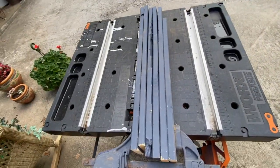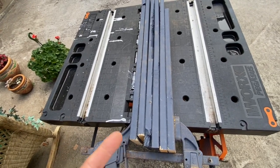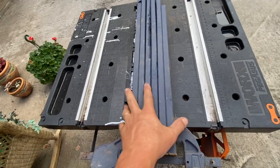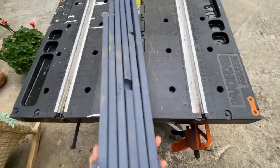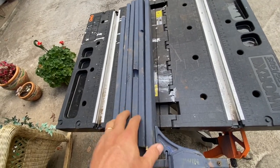and that's why I say two light coats are better than one heavy coat, because that allows you to turn it over quickly and get this side going. And then in just a few minutes, you can turn this side back over and spray this side again without having the paint still be wet and without pulling the paint off.